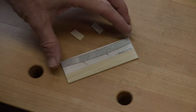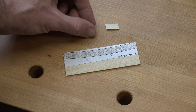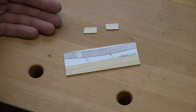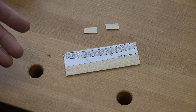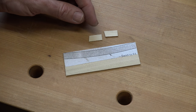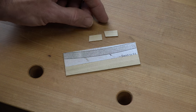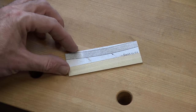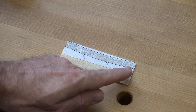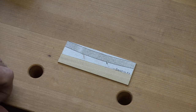I'm going to move on to smaller details, and for that we're going to be doing the sun visor that goes on the front of the rig. These are the brackets here — it's all cut out of one sixteenth inch stock and you can rip it on your table saw cutting to the outside of the blade using that combination square trick I showed you. Just cut these small pieces — these are the small brackets — follow the measurements on the prints. I'm going to use an oscillating drum sander to sand the inside curve and a scroll saw to cut the outside curve, then give it a sanding and glue it on the front of the rig.